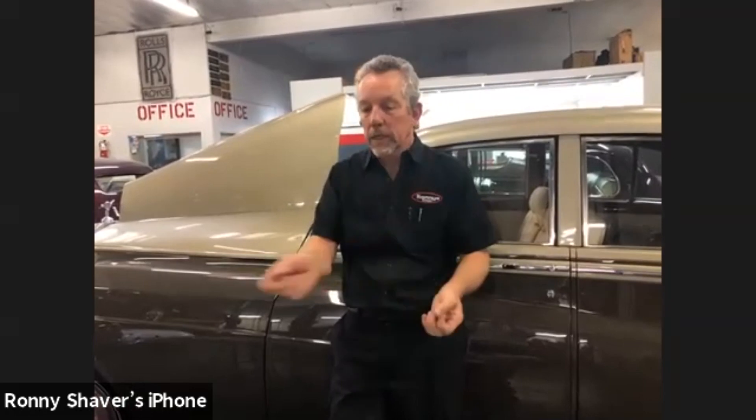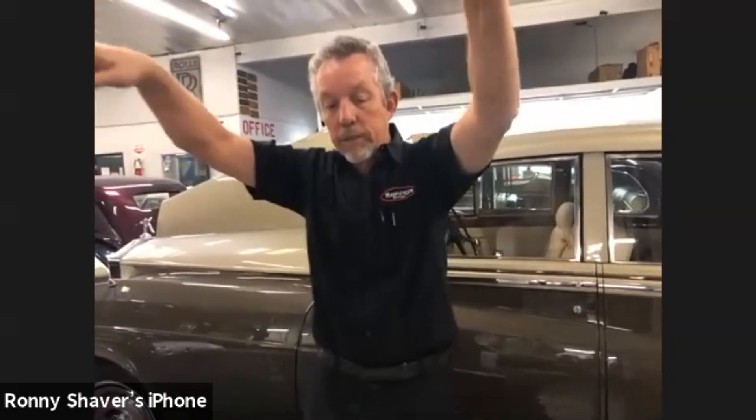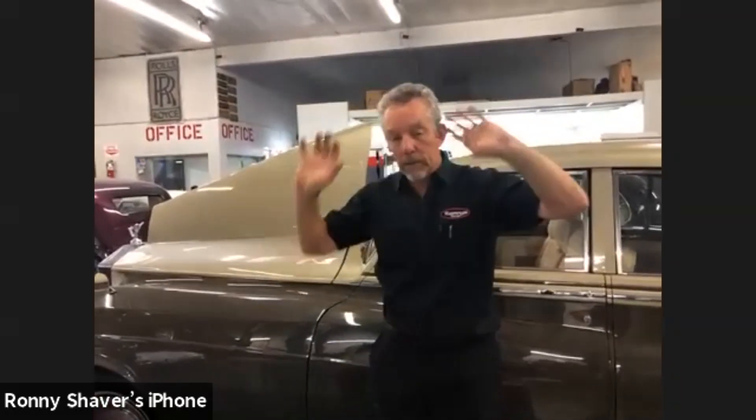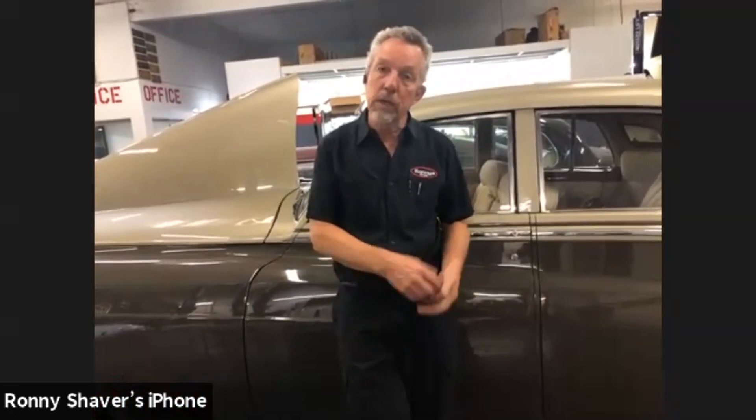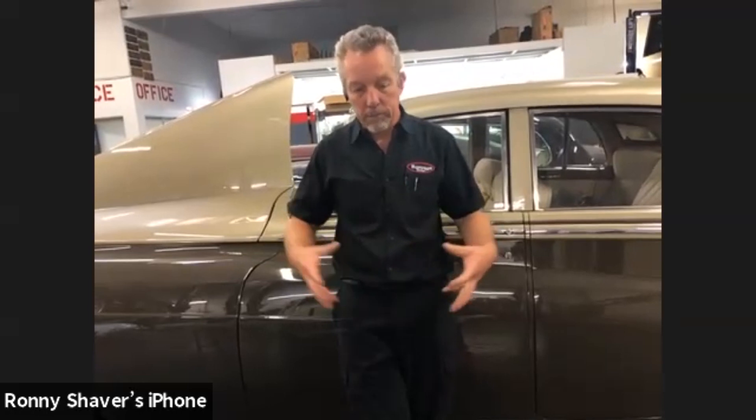To manually move one of those things you can do it, but you're fighting hydraulics. Typically it's best to operate the switch while you're trying to force it in the direction you want to go, and it'll open the valve to let it bypass. Sometimes you can change the fluid, but leaks — a lot of times you go into that box that the pump is in and you'll see there's fluid all over the place, and that's where I usually find the problems. A lot of times the fittings will loosen up and they'll leak. They have little O-rings. A lot of times the pump itself will start leaking from the reservoir.